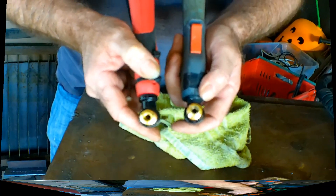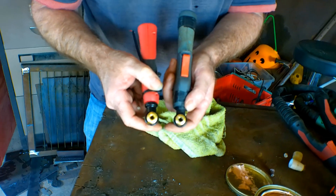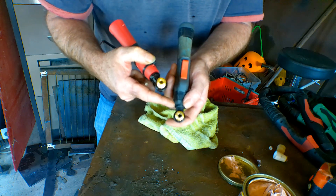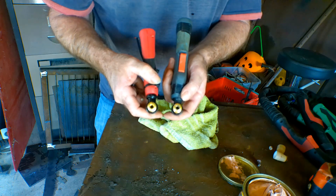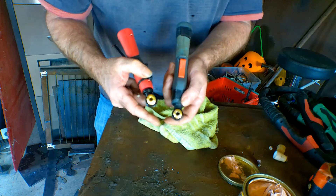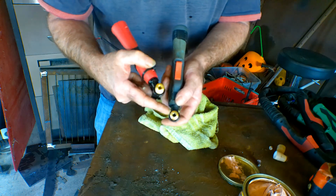See, here's the new one again guys, and here's the one we just cleaned up. I used to throw these torches away when they were like this because I just couldn't get any use out of them. But then I discovered how to do it like this. You'll get another couple of months out of one of these if you clean it up like I showed you — but it's a right pain in the neck. Maybe I'm the only one that doesn't check my electrodes before I start cutting, but it only takes a little bit that you don't tighten it up and then it starts burning out your torch like this.